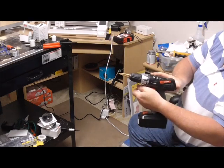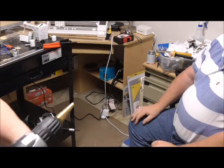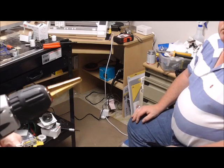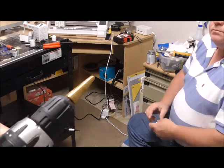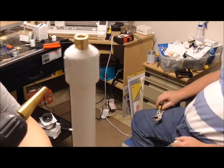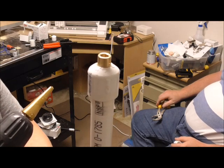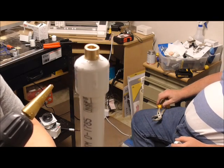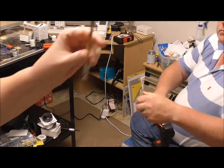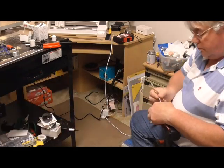Okay. So he'll drill just a starter hole in the lid, and then he's using this step down drill. This is not the step down, is it? Well, that's one of them. So it looks like a cone. And so the farther in you go with it, the wider the hole is. You're just going to make it wide enough so that the motor adapter can come out the top of the cap. Okay, so you're just making it to fit over that. That's just going to secure it and make it really stable. It's quarter. So he's going to use a quarter inch bit to start with, and then he'll use the other one to make the hole as big as it needs to be.